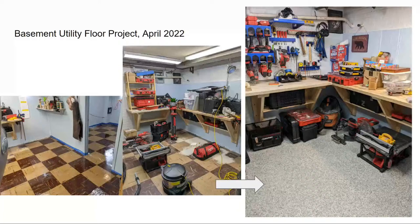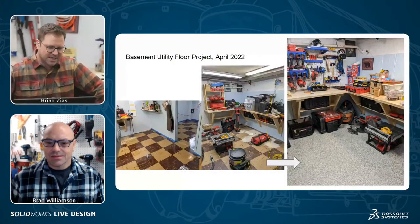On the left-hand side, do any of you know what those floor tiles are? If you see on the bottom left, those almost remind you of elementary school. But those are the old 9-inch by 9-inch asbestos vinyl tiles. So, one of the big things we wanted to do in this house was somehow mitigate that. And you have several options. You could pay a lot of money to have them removed and scraped up. And I didn't really want to do that. So I decided I want to cover them up, kind of encapsulate them, if you will.